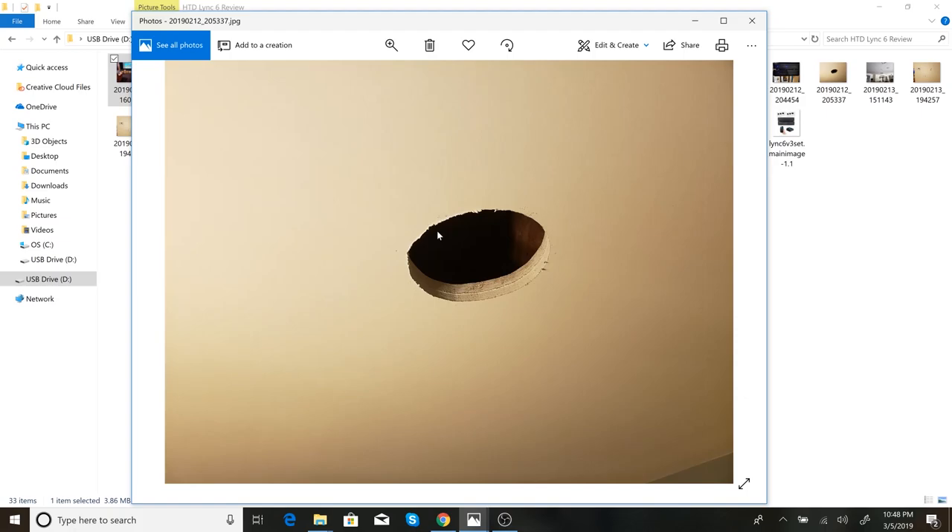Here's a speaker cutout hole. I had actually put cardboard up with the correct hole size for the speakers when we built our house a few years ago. My builder thought he was doing me a favor by replacing the cardboard with 3/4-inch sub-flooring. That would have been fine, except Home Theater Direct changed their speakers from the HD to the HDX model — the cutout size went from 7-3/4 inch to 8 inch. If the sub-flooring hadn't been put in, I would have easily just used a drywall saw to cut it out by a quarter inch. But because of the sub-flooring, I had to take a router and route it out, then use a jigsaw to cut the rest — which made a real mess and was a real pain.